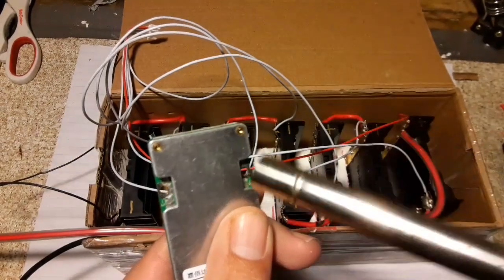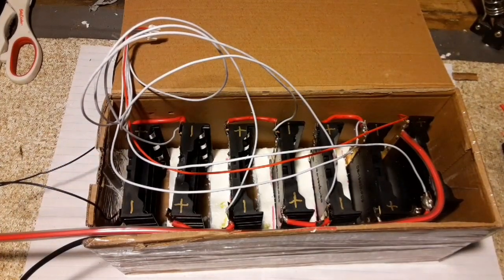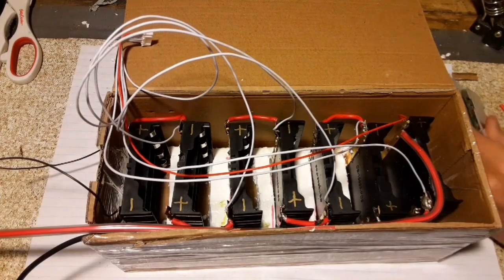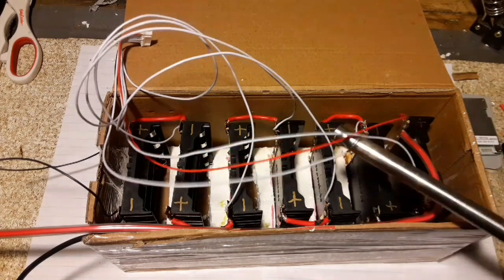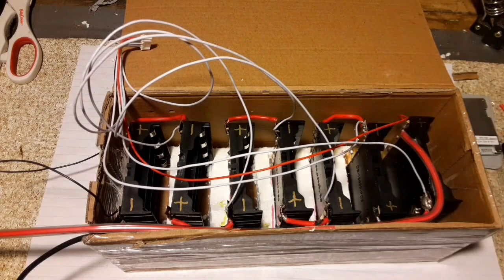You have the power going to the battery pack here and the power incoming from the charger. I think we're going to take this BMS, put it on a little plastic plate, and either stash it in the back corner or right on the front of the box. The main reason I don't have more done is we're almost at the point where we can throw the batteries in it, and I want to run these BMS lines so they're out of the way when I swap cells, and so they don't short out on each other if they get hot.